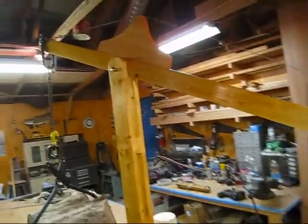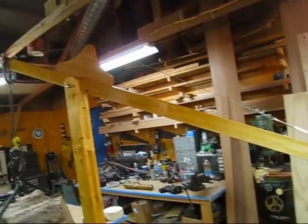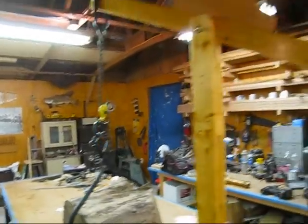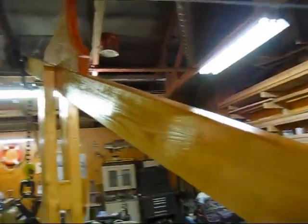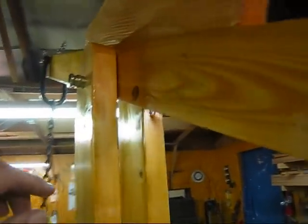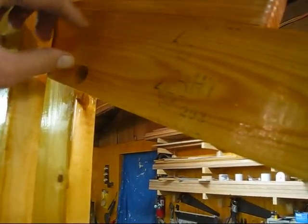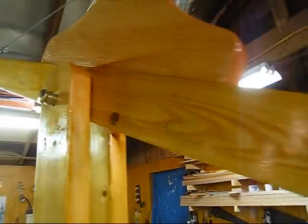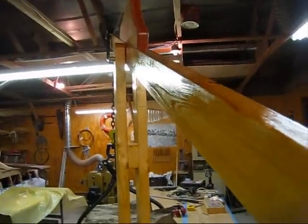The first is a change to this lever arm. If you watched that last video, the last log I lifted was 160 pounds, and with the rigging being 20 pounds, that's 180 pounds. It lifted fine, but there was a bow in this 2x4. There's probably 2.5 inches of solid wood right over the pin, and that's going to be the weakest point. I saw this 2x4 bowing as I was lifting and I didn't like that.